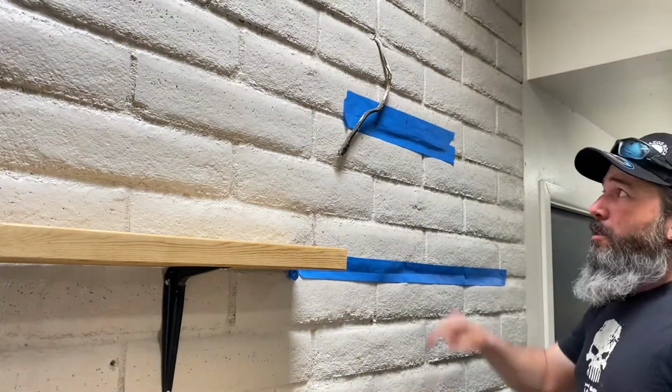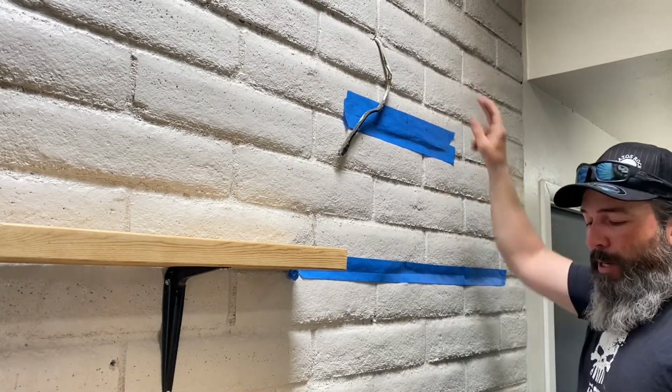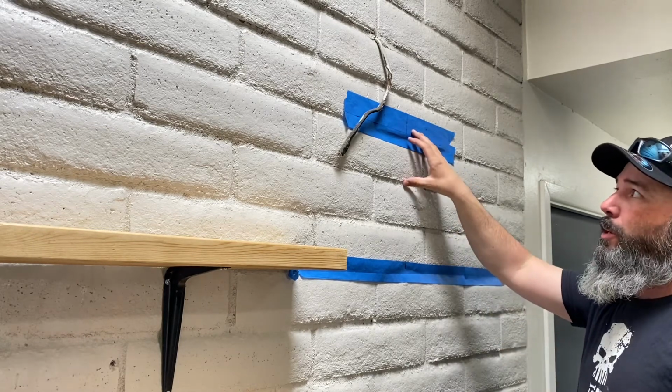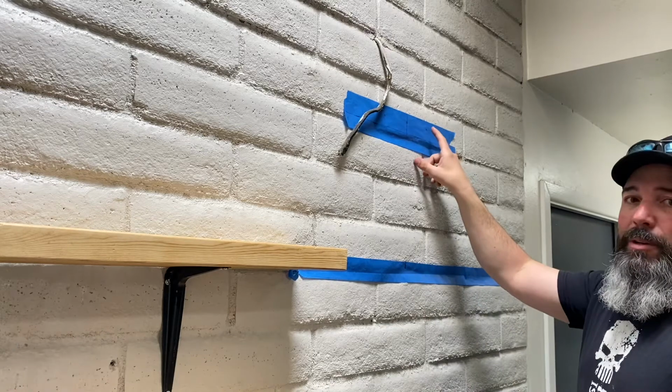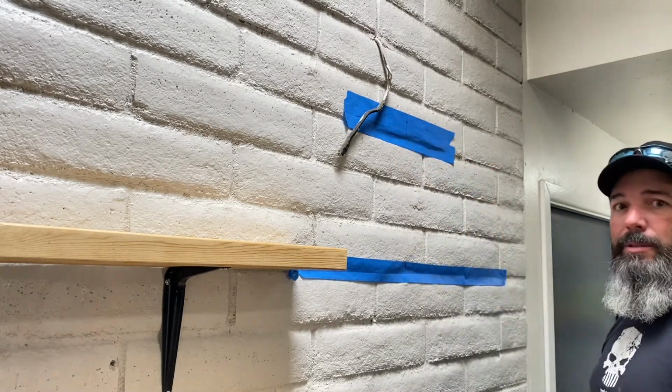So the instructions did not give us a distance between this bracket and the next brackets up for the ductwork. They actually say that we need to install the lower unit in order to locate the other brackets. So that's what we're going to do. We're going to drill the 3 holes here, get this bracket mounted, and then set the unit in place.